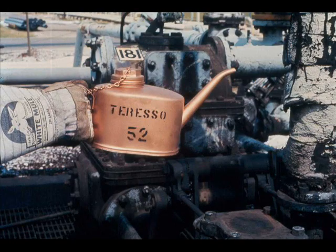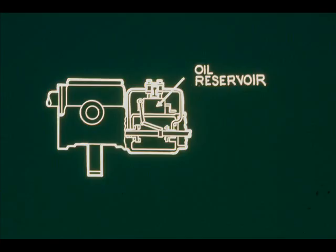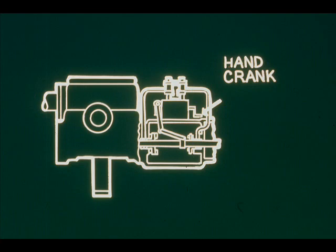Provide proper lubrication and check operation of automatic lubricators. For example, a steam-reciprocating pump may have a force-feed lubricator which looks like this. This lubricator is a small pump. A force-feed lubricator contains an oil reservoir. Before you start the pump, be sure the oil reservoir is properly filled with the correct lubricating oil. While the pump is running, its rod or shaft operates the lubricator, pumping lubricant to some of the pump's moving parts. Since this power is not available until the pump has started, give the hand crank a few turns before start-up.